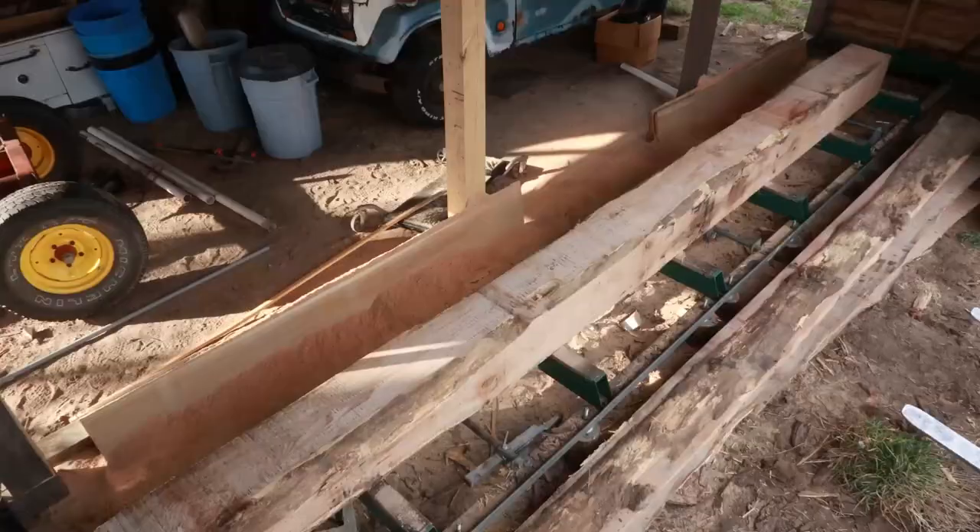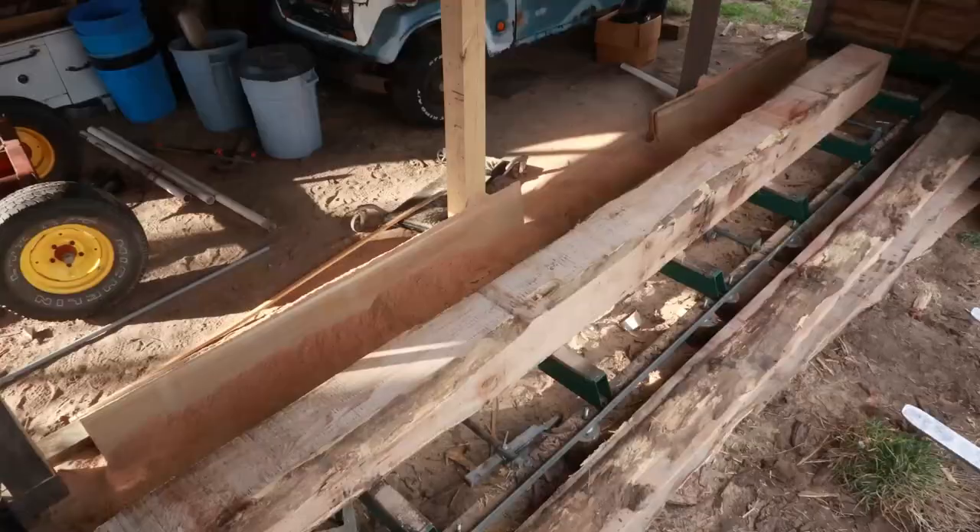Since it's 12 inches, we should get three 4x8 beams, and hopefully two of those will be usable. That's my plan — that's about all I can do with this at this point and hopefully get something out of it. And then, assuming I get two usable 4x8 beams, since the rest of it's in 4x-something measurements, I'm hoping I can possibly get some 4x4 beams out of it that are going to go side to side on top of these 4x8 beam stringers that are going to stretch the length of it.